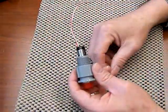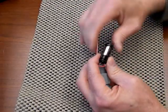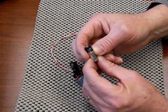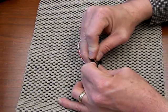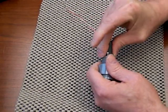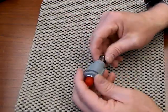At this point you'll see the battery sticking out of the back. To replace the battery, all that needs to be done on the majority of units in the field is pull it out the back and replace it with a new one. The battery type is a 12 volt type 23, and these are very common within the US — you can buy them at Walmart, Kmart, Radio Shack, just about anywhere. Replace the battery and push it back in until it's snug.